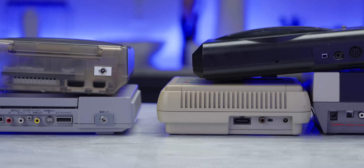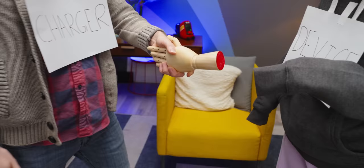What we need here is science. In order to determine the correct voltage, a handshake process takes place between your charger and your device. The charger says, "Hey, how many volts do you want? I've got five, nine, 15, and 20." And the device says, "I'll have nine volts, please." They synchronize their watches and shake hands, completing their electric ritual. But these old devices are, to continue our handshake analogy, completely handless. They have none of the requisite circuitry to respond to our charger's inquiry. So how do we give them a hand?